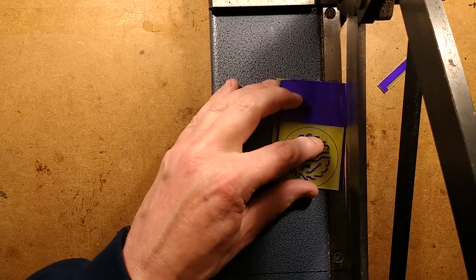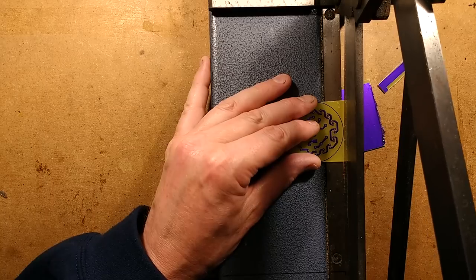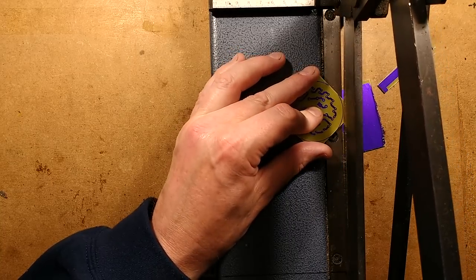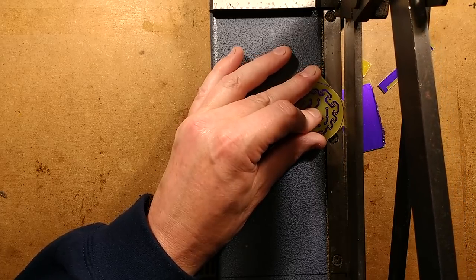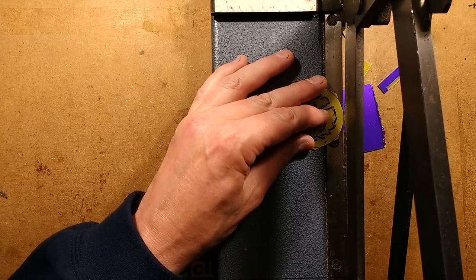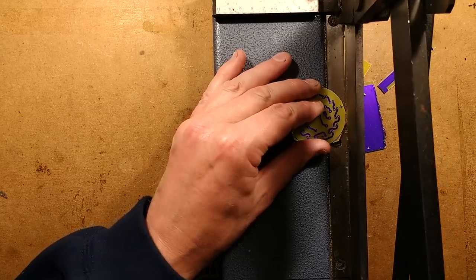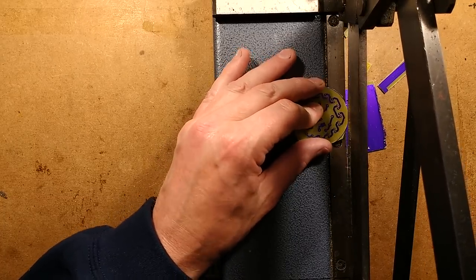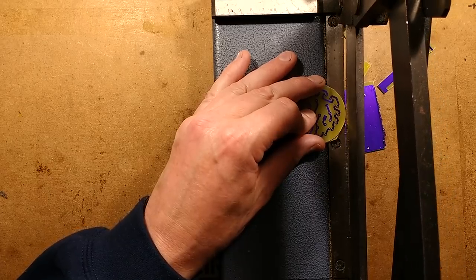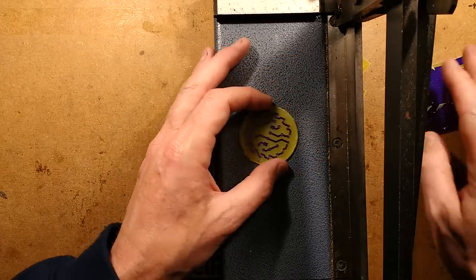This circuit board is round and the best way to cut a round circuit board is with a guillotine. This is an expensive piece of equipment, justified at the time along with my tri-tank etch unit and the ultraviolet exposure unit — I manufactured so many circuit boards by hand that stuff like this was justifiable. What I'm going to do is cut right to the edge of this circle, cut four sides, then cut again at a diagonal, and again, making it rounder and rounder as I go. Then when I can't cut any more off conveniently, I'll come back with a Dremel-style sanding disc to grind the rest of the material off — it's going to make an absolutely huge mess.